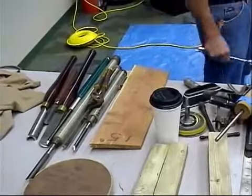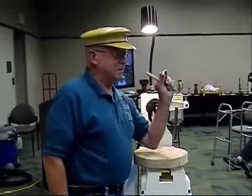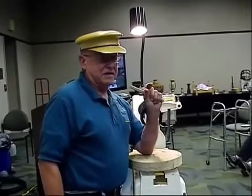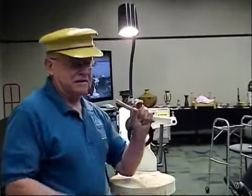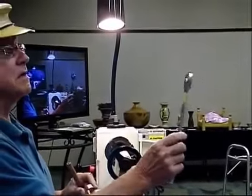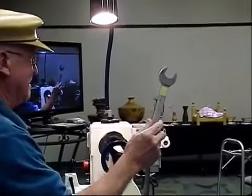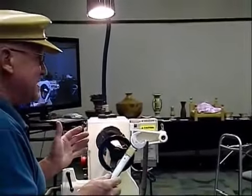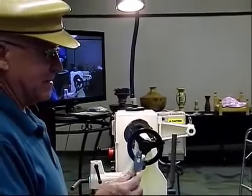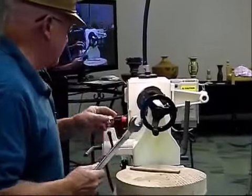This is also critical. I think you can buy these at the hardware store. They come in exact dimensions, inside dimensions. That's your tenon size. And this is your special cutting tool right here. I think it says Sears on there, but these work too. Anybody ever use these? They work good some places, sometimes not. If you get it in wood that kind of chips, they're a little more aggressive, but just sharpen the top side. So those are some options.